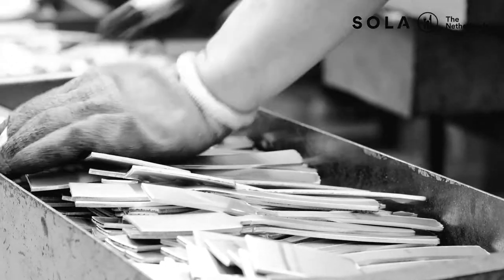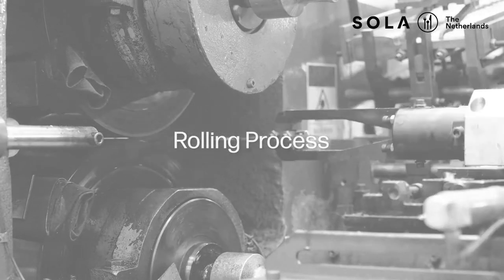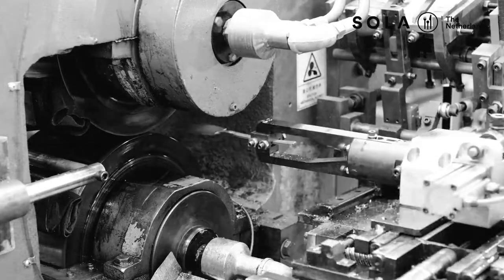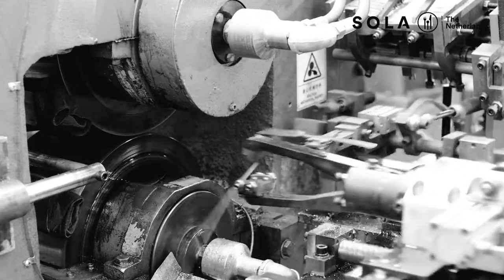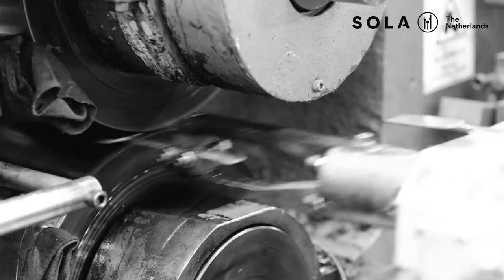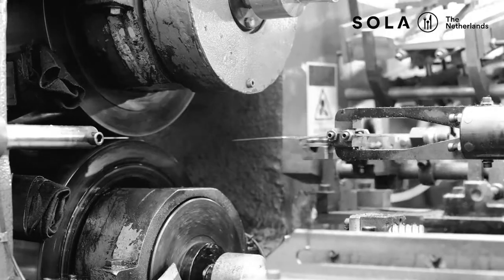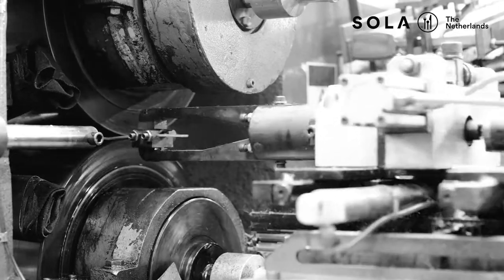The pieces are very rough and have burrs on the sides. The following step is the rolling process. Rolling is the process where the head part of the fork and spoon is formed. The spoon bowl does not need to be as thick as the handle, otherwise it will be way too thick. The top part is rolled under two contra-turning round presses. The thickness is set at a specific value and the head part is rolled between these two presses and will basically get squashed till it is thick enough.